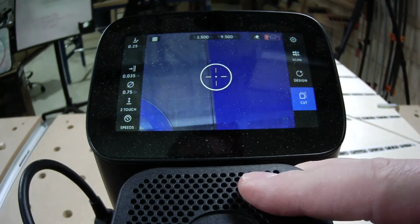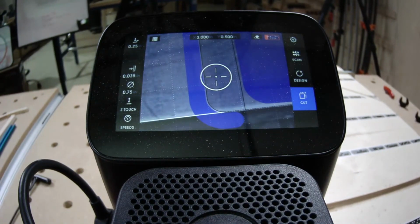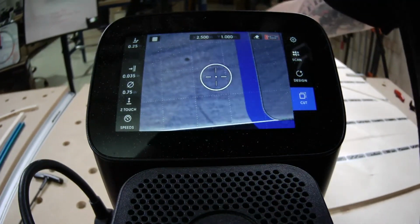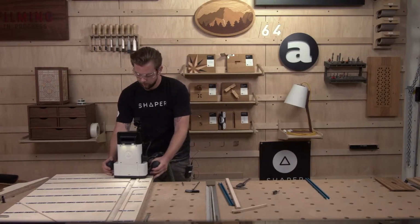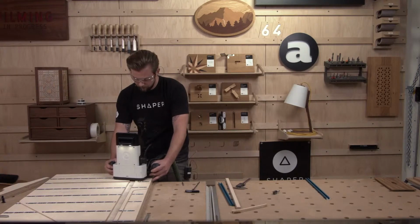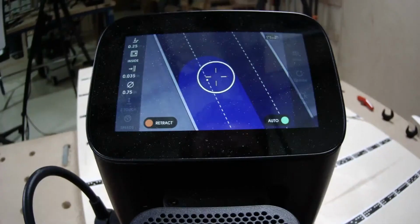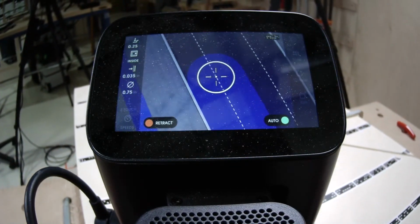All right, I'll make this quick. Okay. So 0.035 offset coming down from 0.04 means that Jake's only taking 0.005 inches off per side. Just really fine tuning the width of that cut, because we know that that test fit was right on the edge of being able to hand fit those two pieces together.